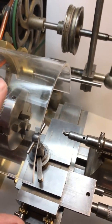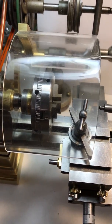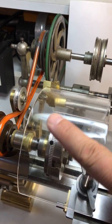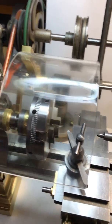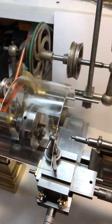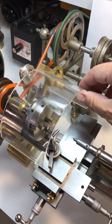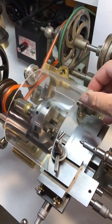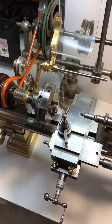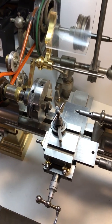I did find that the piece of acrylic needed to be sanded starting with 220 and all the way up through 3000 grit, and then take some acrylic polish to it in order to get a very nice clear finish that didn't have a ton of distortions so I could see what I was doing. So that's the new chip shield that pivots up and down, that should make things a lot more comfortable and I should be able to go upstairs without taking quite so many little pieces of brass in my hair.